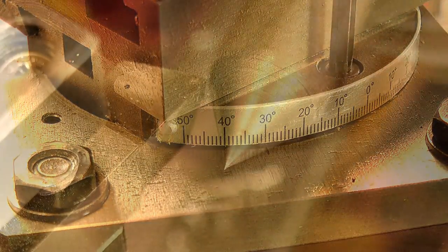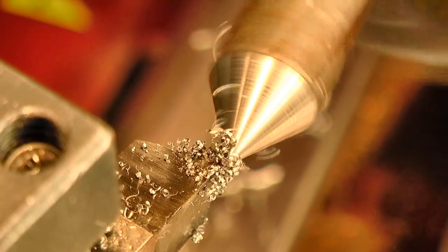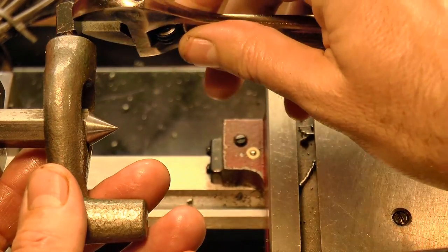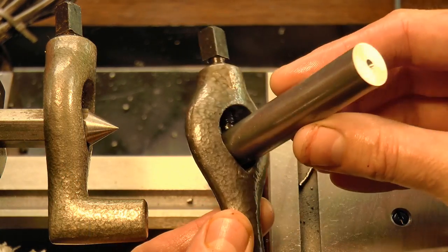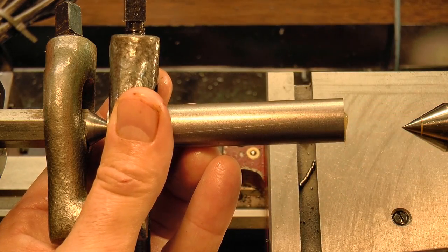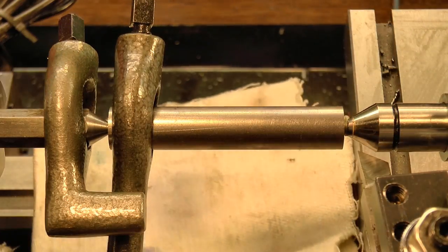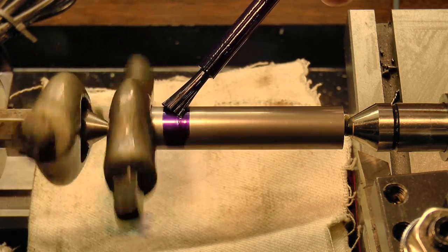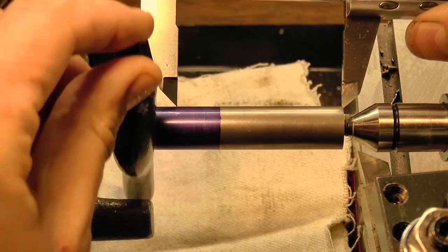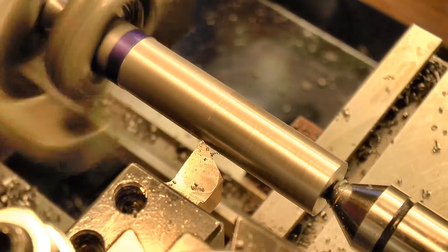To be honest, I find it more convenient to do this than to take off the chuck to put in the center anyway. And since it's turned in place, I know it's right on the center line of the lathe. A lathe carrier was attached to the work and the part set up for turning. With the first cut marked out, I started the job of turning the profile to size.